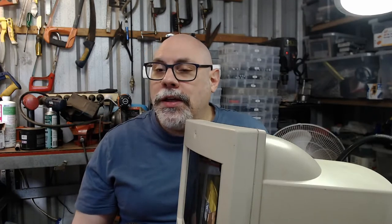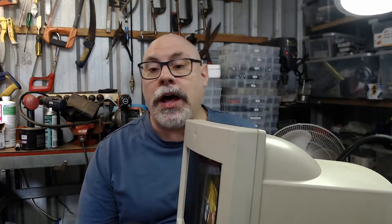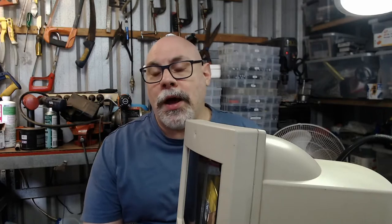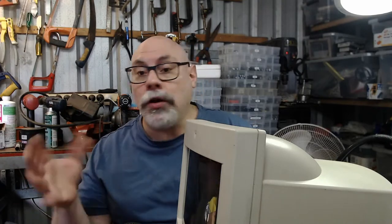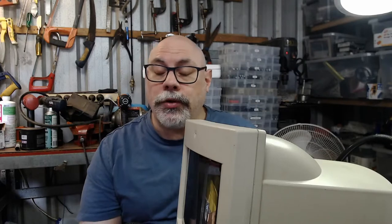When I told him that ultimately the only thing I could find actually wrong with it was a failed hard drive and a dead speaker, he said, that may well be the case. I know it stopped working and then I stopped using it, but I couldn't remember exactly what happened. He was totally unaware of the fact that it had already been recapped. So I gave that board a clean. The recapping didn't really need to be redone. It was a good enough job to leave it as it was.